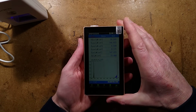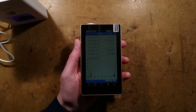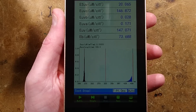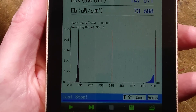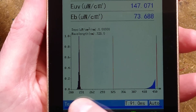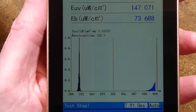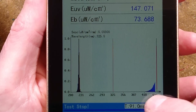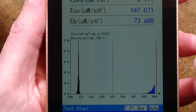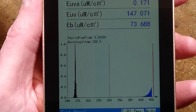A lot of research has been done into this, including the very exciting step of actually having people look directly at it. I'm going to take the exposure off and zoom down. Here we are at the very narrow wavelength — it puts out 222 nanometers. Very impressive. That slight curve at the end is just the ambient lighting catching the very end of the visible spectrum, because this spectrometer goes right up to 450 nanometers and it's getting the blue from the LEDs.